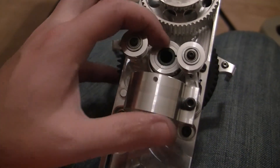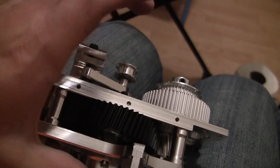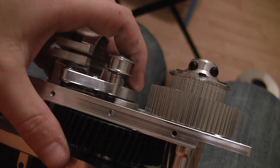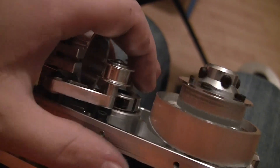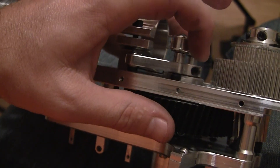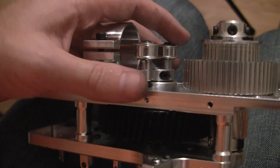Put the collar on. I kind of like this because it's easy to get to — real easy to push everything and hold it and tighten that collar like you need to. Basically push the shaft down and push this against it so you're pinching it, and just lock it down like any other collar. There's a bevel on one side of this collar so it hits the inside of the bearing, so just be careful when you're doing that. It did say to spread a little blue Loctite on the inside of the collar, and then Loctite on your bolt there as well.